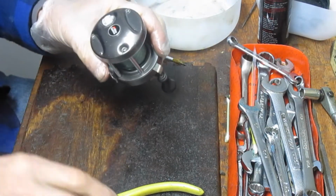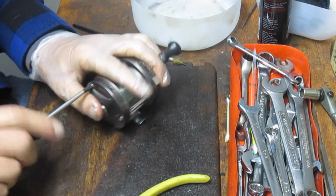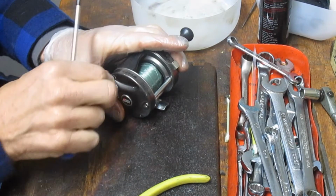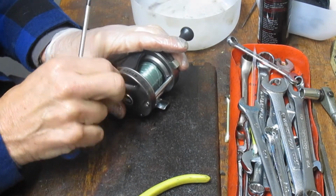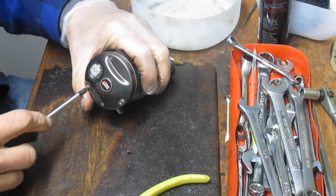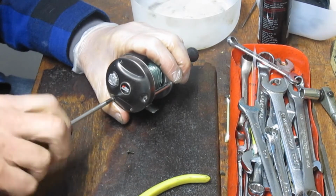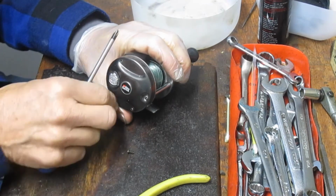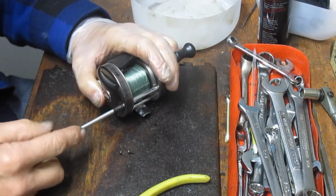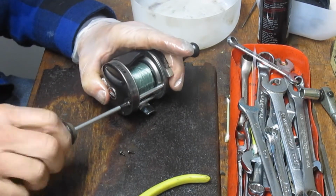All right, over here to this side then, pull those 3 side plate screws. These are different, so again, lay them out on the desk so that you know which ones go where. And I'm just noticing that this one's got a bigger sized screw head than the other two, so I'm going to assume that that's a different one. May just be a replacement screw, don't know, but it doesn't hurt to notice where these things came from and put them back where they were. This is a larger screw here because it's mounting the crossbar in the back there.